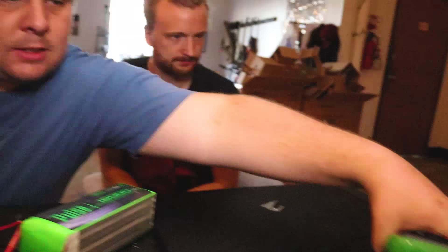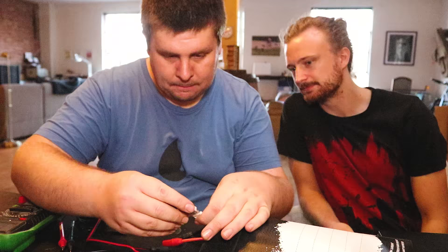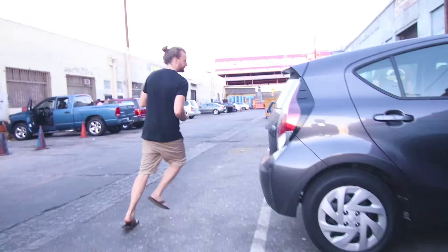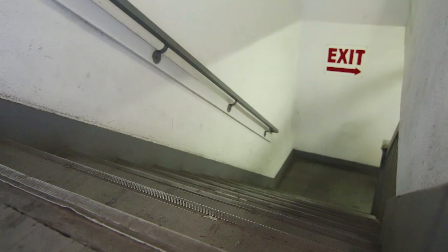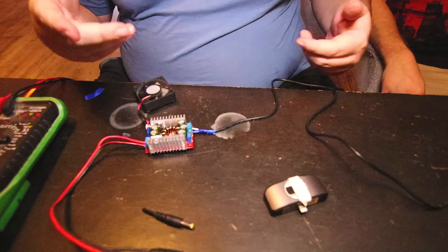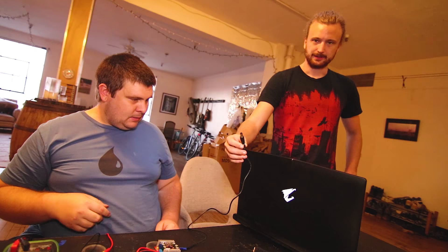That's our power in. Now let's turn up the multimeter. So 24.2 is what our master is. Let's go and see what our cell states are — 24.4, cool. Checking our output: 19.6, so that's good. We're getting the proper voltage out. This is a big moment of truth right here. If the charging icon shows up on the laptop, we know it's working.